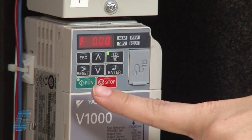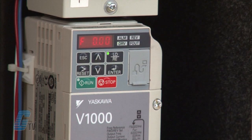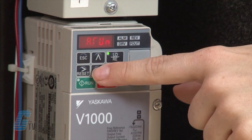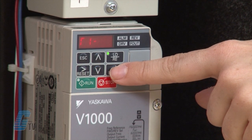The last two buttons are the run and stop buttons, which will run and stop the drive. I will now start entering my data and arrow down until I get to auto run, also called auto tune. This will allow me to enter the parameters for my motor.